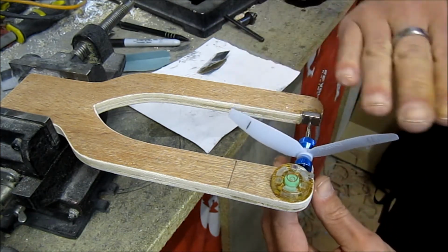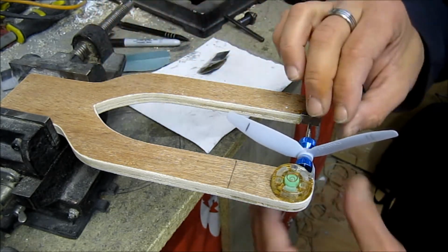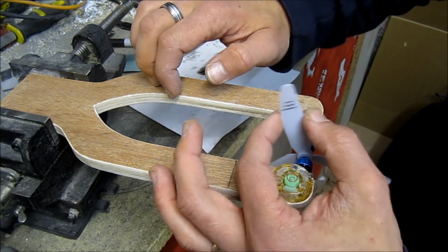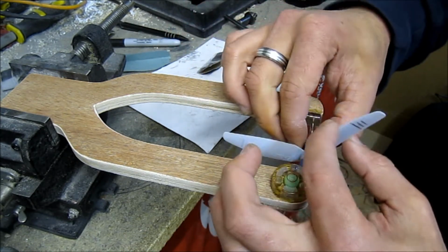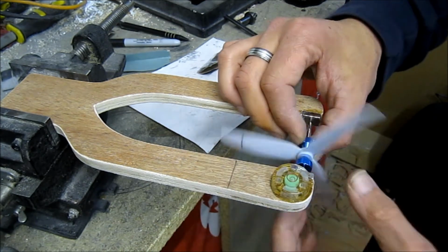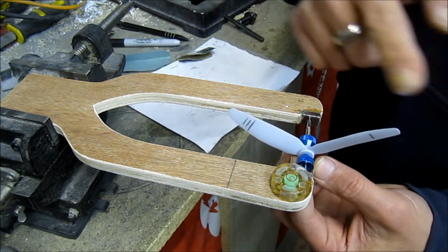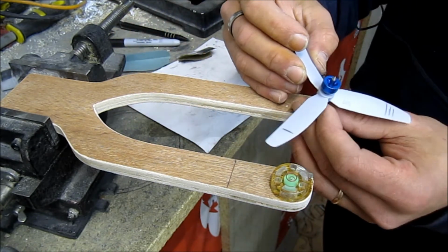When I'm putting it on like this, it's all level here. And to double check for precision, because number 3 is the heaviest, I'm putting number 3 on the very top and looking where it's going. If it's going that way, where's my number 2? That means number 2 is still slightly heavier. If it's going back, that means I sanded too much and I have to go back on number 1. Right, so my number 1 and number 2 are matching now in weight. So from the pivot point, all the radius has to be balanced, whichever way you put the prop.